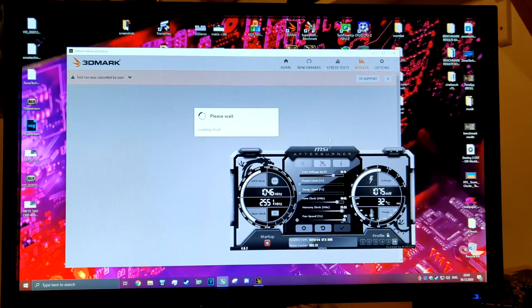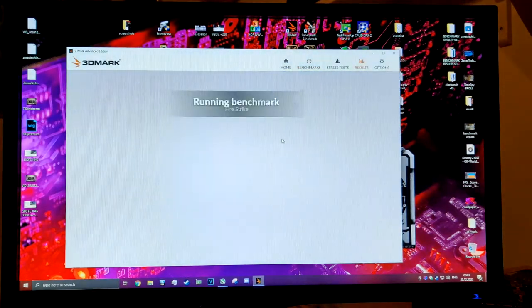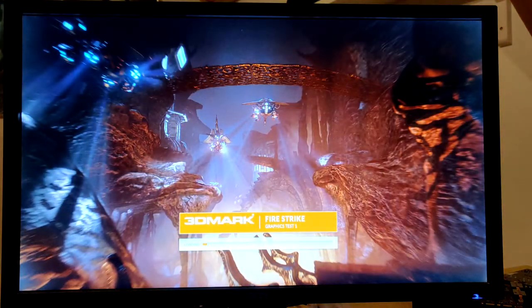2525. Is that gonna run? I don't know where the memory straps change on this card. I guess it is changing at every 100, so like 2500. Or maybe at 2500 it's using one memory strap, and everything higher than 2500 up to 2600 it's using a different memory strap, and that memory strap might be too difficult to run for this card right now.